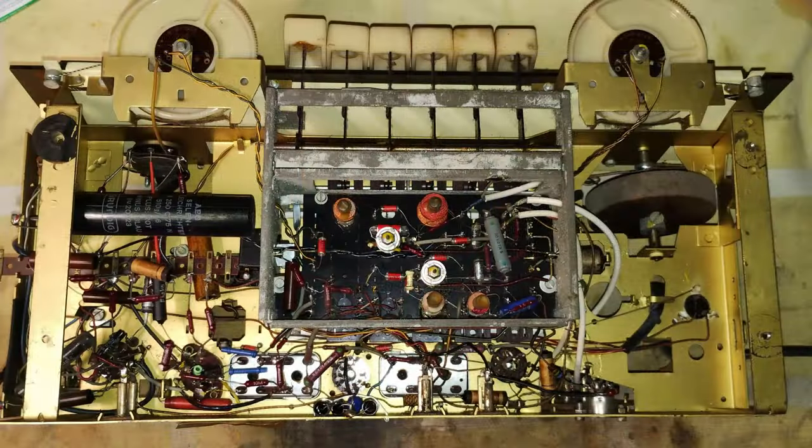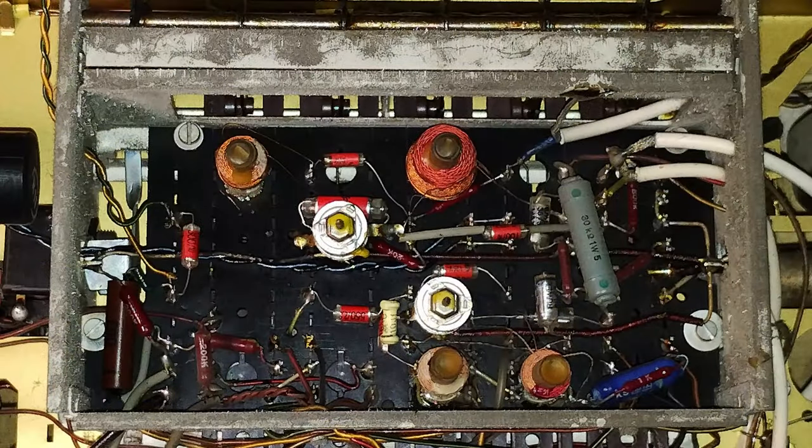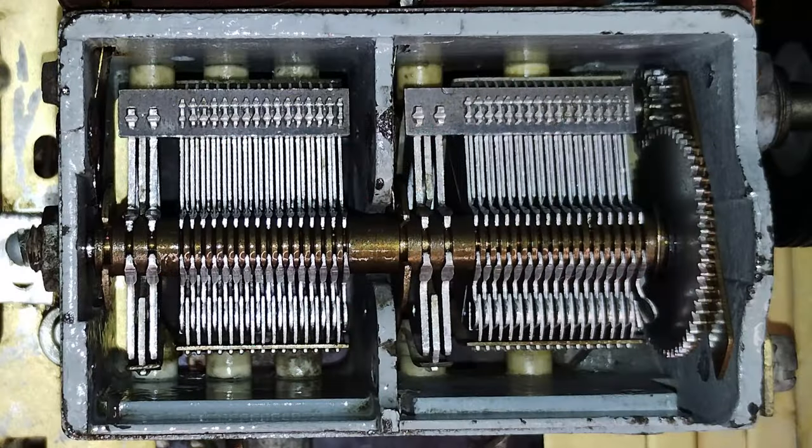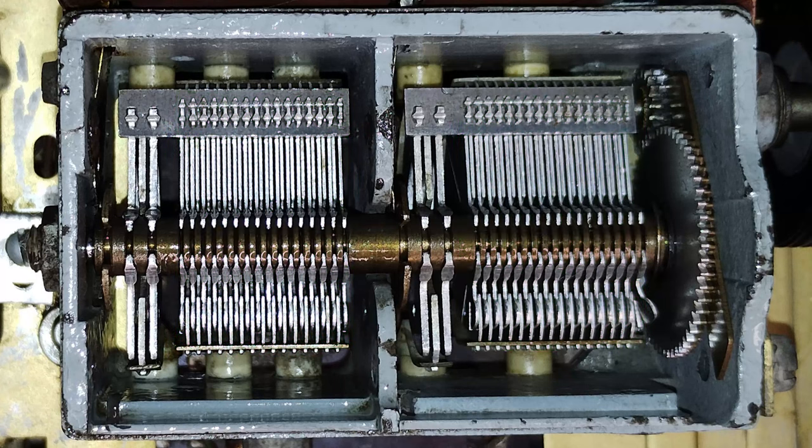Ideally, all the chassis should have been cleaned using a dishwasher to get rid of all the zinc particles spread around by broken whiskers, but that could not be done, because the thin threads of the RF coils on the board attached to the keyboard switches would not have stood the water jets. Later, it was found that the AM sections of the variable capacitor were shorting, maybe in relation to this whiskers problem.